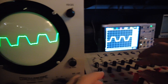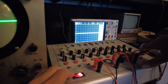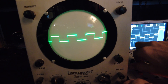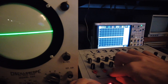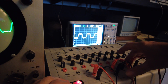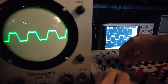If I turn these off — I can turn each of these individual harmonics off — and then if I turn on an actual true square wave, you can see this square wave looks and sounds very, very much like the Fourier-constructed square wave from the fundamental, the third harmonic, fifth, seventh, and ninth harmonic. We can create various sorts of wave shapes.